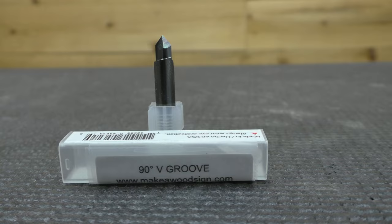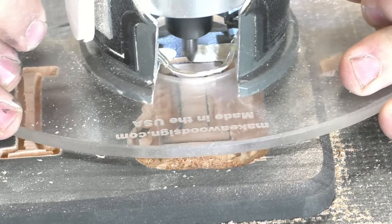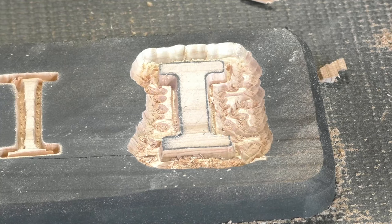Next on the list is the 90-degree V-groove. This is the one I primarily use for background around outside letters. I like a textured background — the 90-degree is my go-to for background on outset letters. The second reason to use the 90-degree is for large inset letters, like three inches or above. With large inset letters you want to take out as much wood as you can, and the 90-degree bit gives you enough room to get inside those large letters and then take the background out however you want.